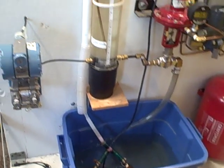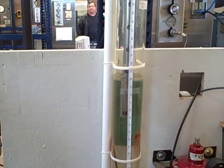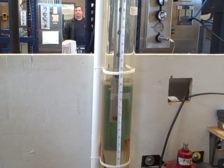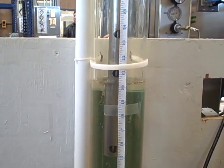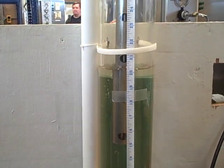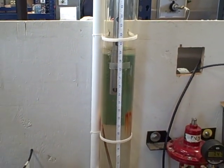The indicator level is a little less than 50%, which permits a certain amount of water to flow through to maintain a level. Right now we've got the set point on our controller set for 50%. The range on the transmitter is 0 to 40 inches, so 50% of 40 inches is 20 inches. It does say we're right at 20 inches, right at 50%, so we've got a slight calibration error with our transmitter.